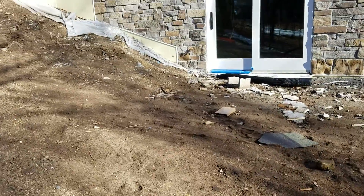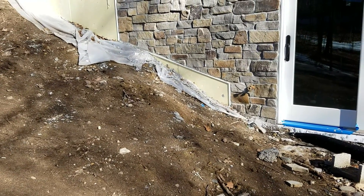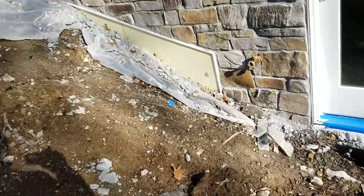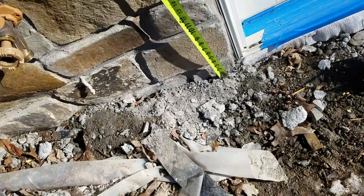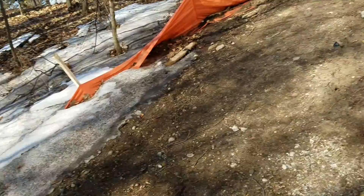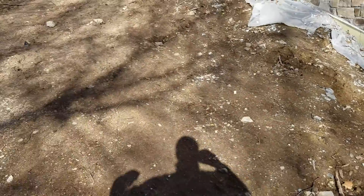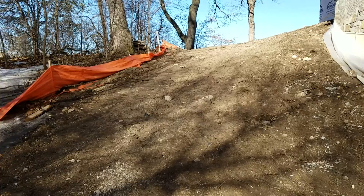Right here where they've got foam, we're going to be building some walls. There are two walls coming through here — one starting right there and one right there. I'm not comfortable with having that much of a slope, so let's go with two 32-inch walls over here just to be on the safe side. These are going to come out a little ways, but we've got steps on the outside of them. If this is a 12-foot patio, we'll call them four-foot slab steps going up — and any time I say slab steps I'm referring to those outcropping steps.